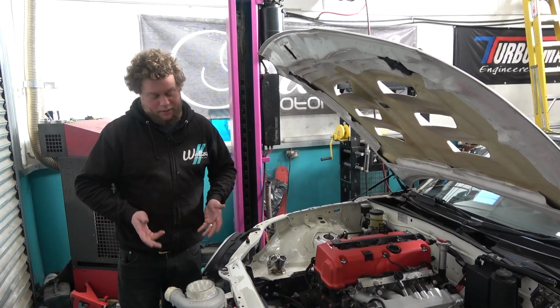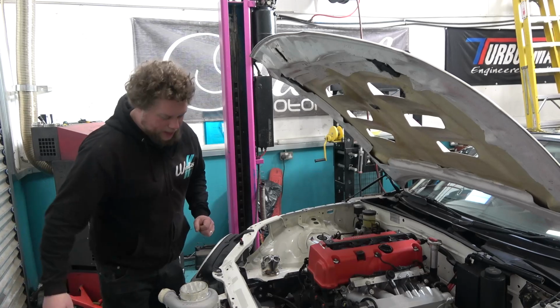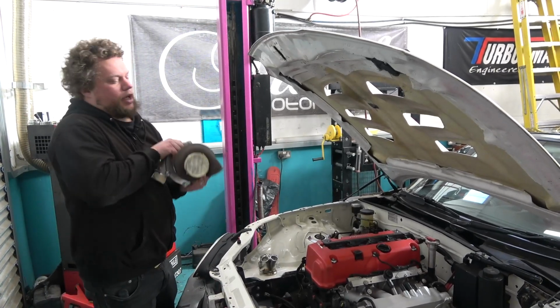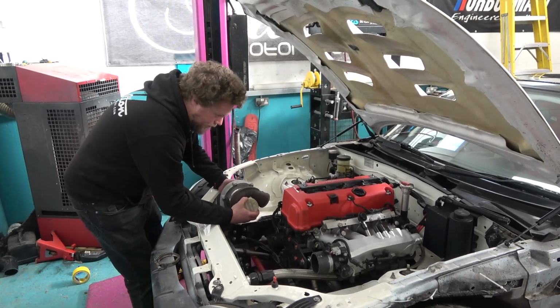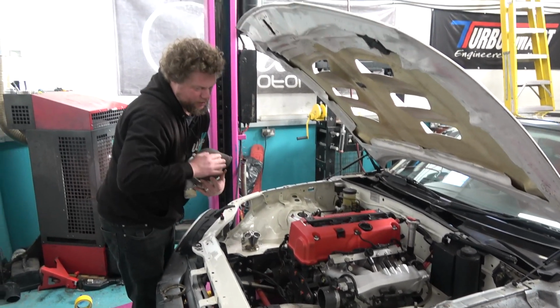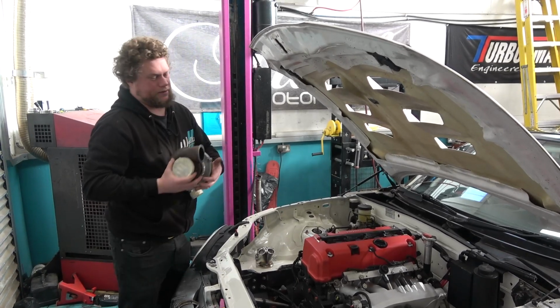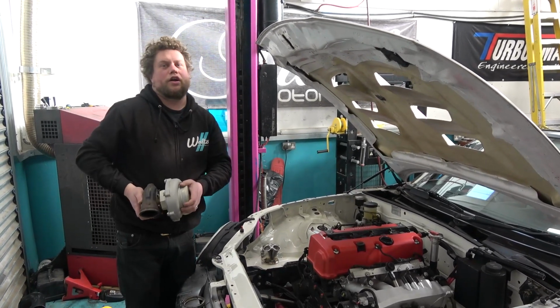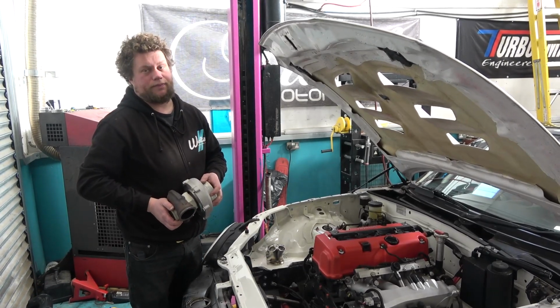Well, I'm not making a downpipe anyway, I'm only making the manifold, but that's why the turbo can't go in that position and has to go in this position here. So the downpipe will then run the other side of the engine, go over the inlet manifold and disappear back down using the standard exhaust tunnel that is there on a standard MX5.